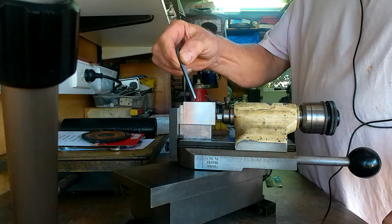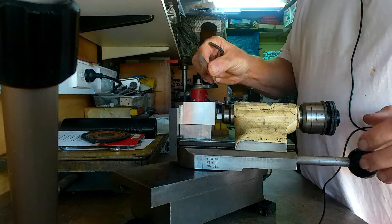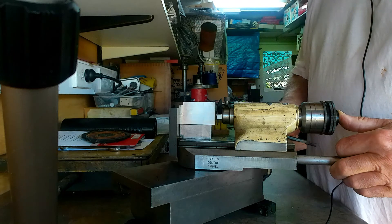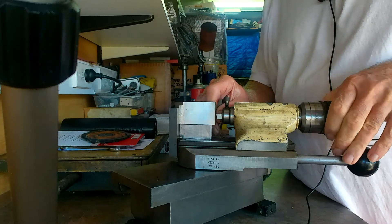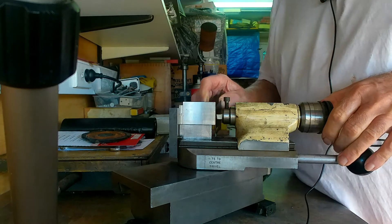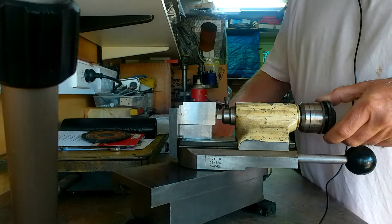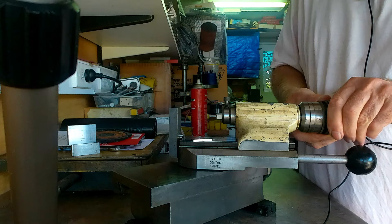I'll now have in place the 2.225 slip gauges. I'm going to use a piece of quarter thou shim to protect the slip gauges from the tools. I'll just lightly push that forward, lock the carriage on there, and make a fine adjustment on here. We're there — zero the dial. That's a train going by, sorry. Set the dial to zero, remove the shim, remove the slips, and advance another quarter thou to compensate for the shim.